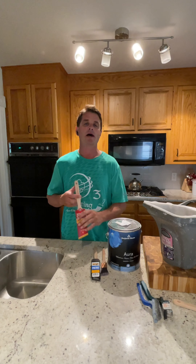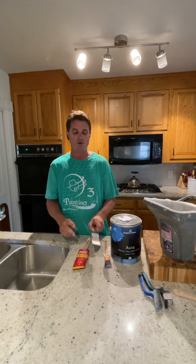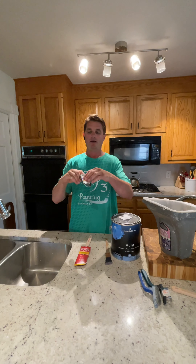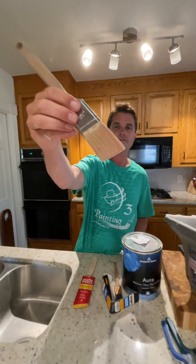Hello and welcome back. In this video I'm going to give you some tips on how to use a paintbrush the right way and the most effective way. When I cut in, I normally like to use a one-and-a-half inch angled brush. I use this to cut in against the ceiling, against the door casings, and against the baseboards. When you cut in, you only want to cut in about an inch or two away from the casing, because then you're going to use the roller and roll as close to the casing as possible.